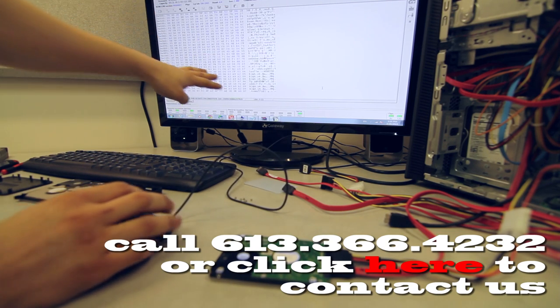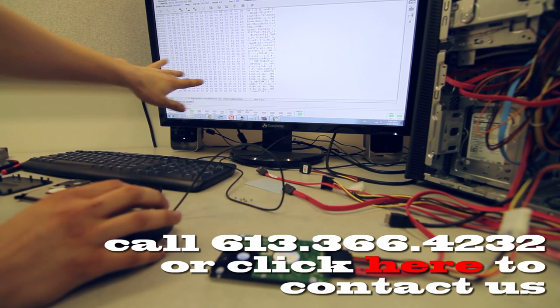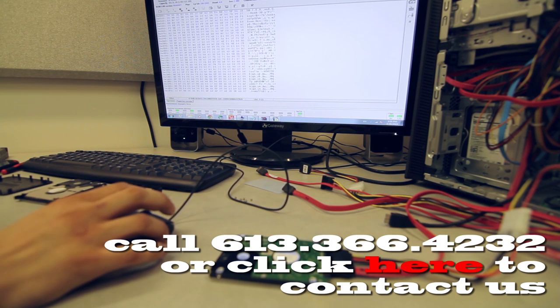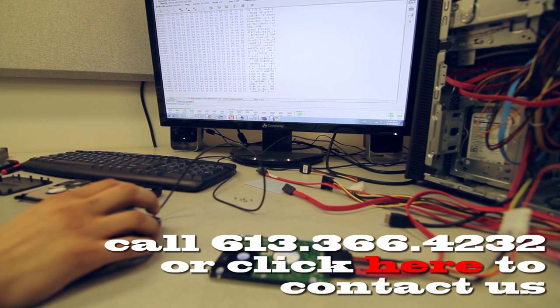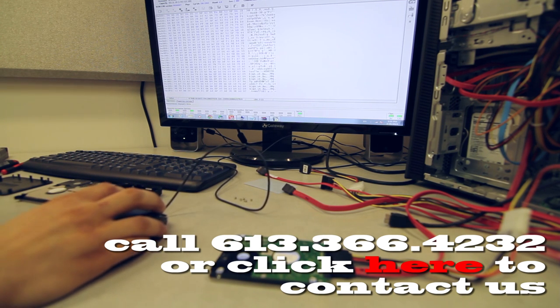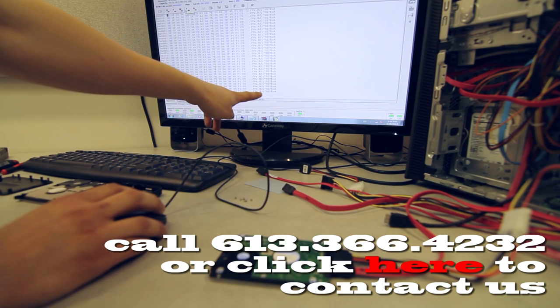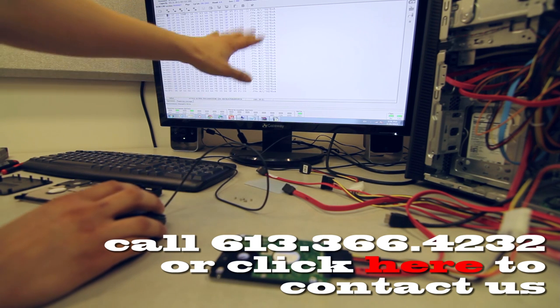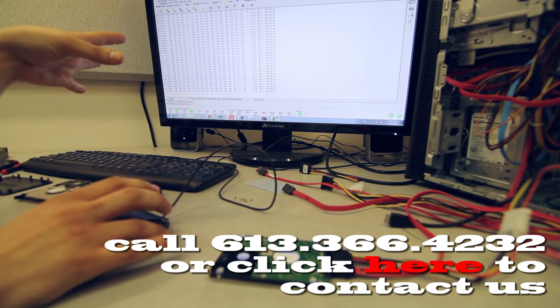What we see here is the encrypted version, okay? There is nothing that I can recognize as far as the writings. It usually should be something along the lines of no bootable partitions found, because this is sector zero. And if we look further, this is also encrypted information. As you can see, this is a pattern for most likely encrypting zeros. That's what the zeros would look like in an encrypted form. Instead of zeros, we see a bunch of different digits.